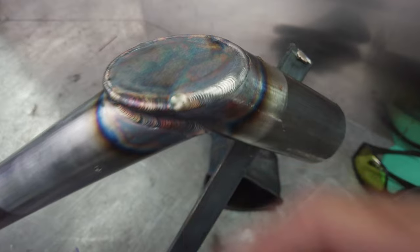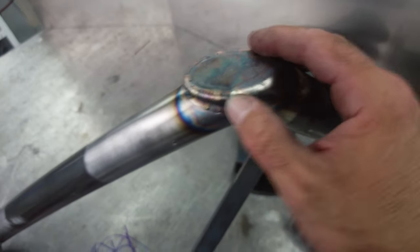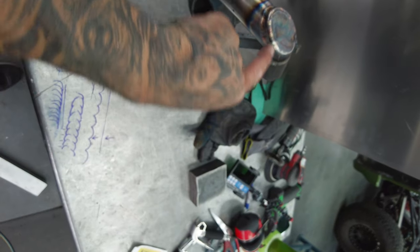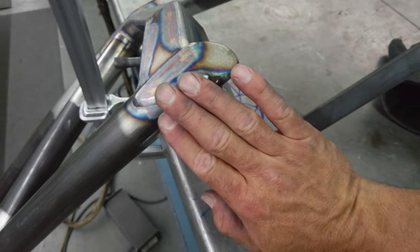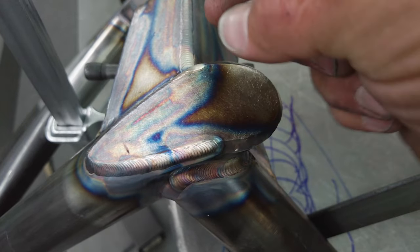I choose where that start-stop is because no matter what, when you end that weld, unless it's getting welded on top of, you're going to have a very obvious start-stop. And what I chose is the bottom of the bumper. This is the very bottom of the bumper. You'd have to look under the truck to see that start-stop. So everything on the top you see, but you don't have to see that breakup. And that's the same thing I chose here. So this is the bottom of the bumper, and I chose to have that same program where it starts here and I'll wrap it, and then I'll drop right around, and then boom, in there, and that's all the bottom of the car. And this one's done.